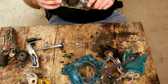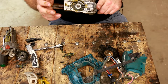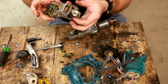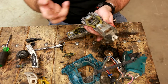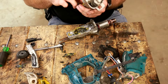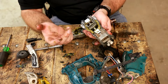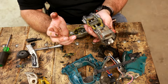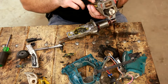Here's the secret — this is actually a spur gear. That's what slows the motor down so the blade isn't going incredibly fast. We use sawzalls all the time in my dad's HVAC business and go through them quickly. Generally what happens is grease comes out the front, and then it's just steel on steel — high-speed steel on steel — and that thing is going to cook. Your run time is severely limited.